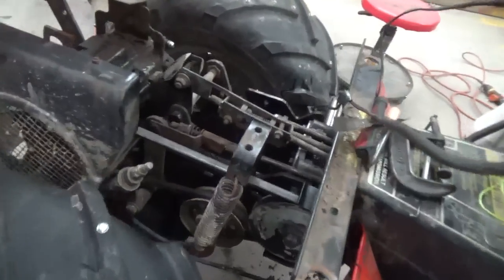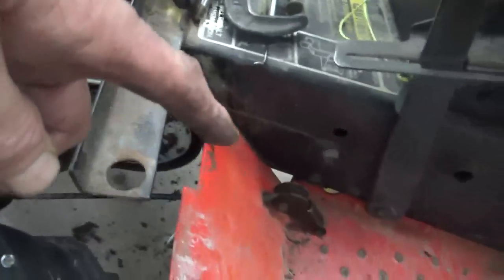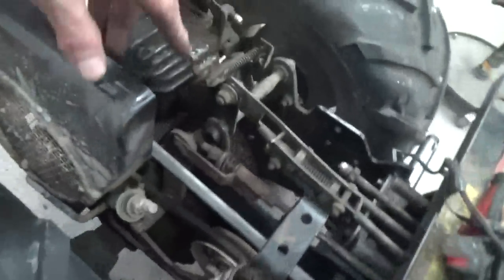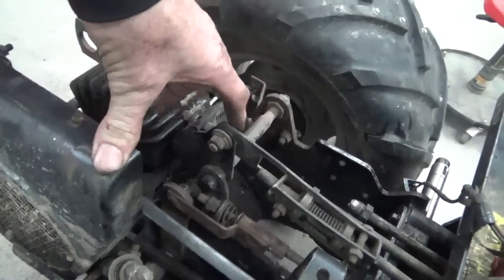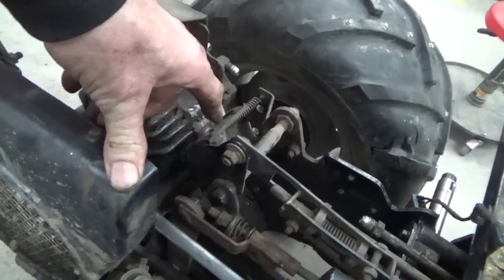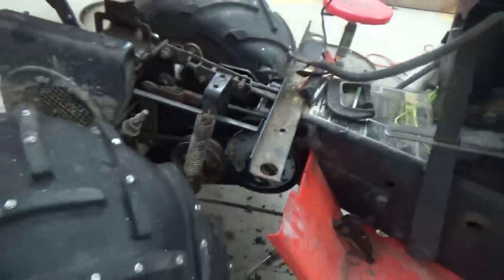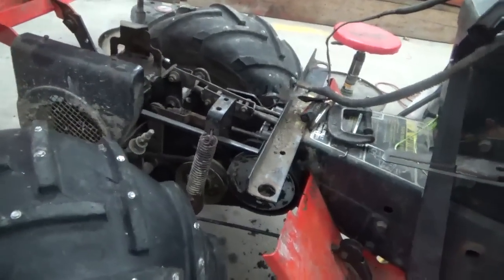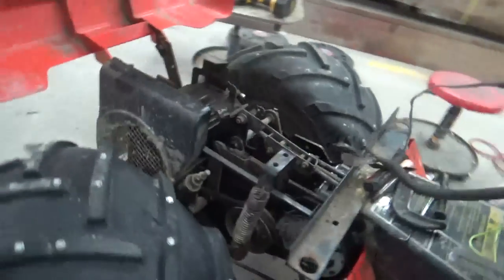Okay guys, so the belt, the cover, got the nut tightened up in there, put the emergency brake handle on, and also hooked up this hydrostatic shifter from forward to reverse. So the only thing on the top here to hook up is these two lines. I'll do that from the other side. So looks like we ought to be alright there. I think everything is the way it should be. We'll soon find out once we get it going.